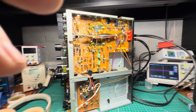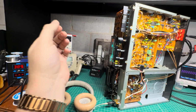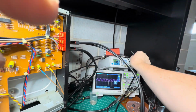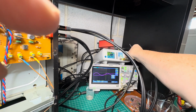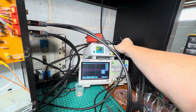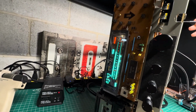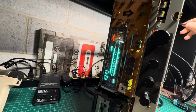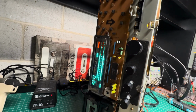All right. So now what I want to do, check indicator levels. So I need 400 Hz. Okay, levels good. We need 0 decibel. Okay, levels good. Adjusting left and right channel. 0 decibel, 0 decibel. Okay, done.